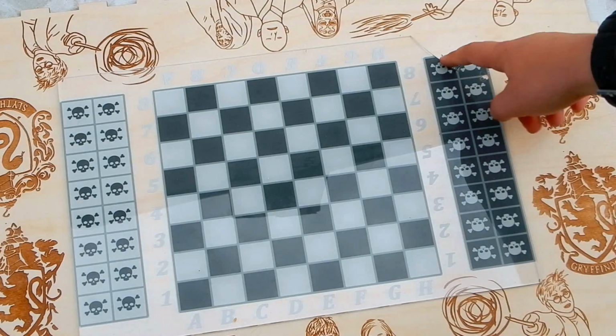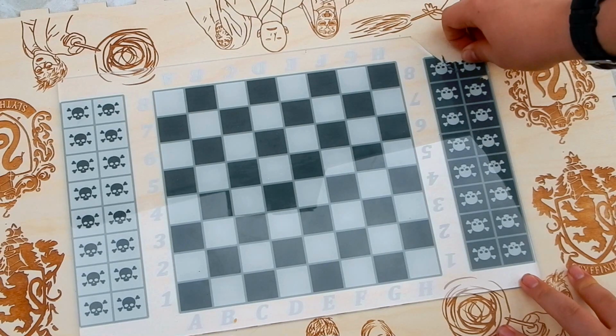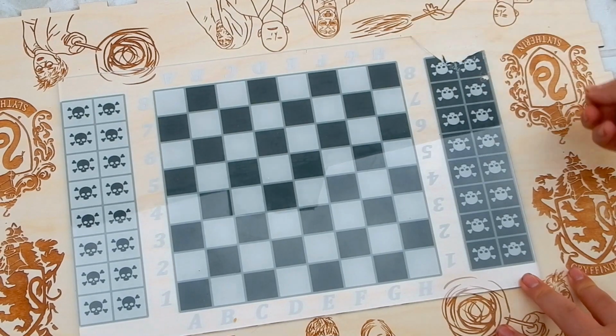So the company that engraved these parts for me said they could not only engrave but also just print. So I let them print the chessboard itself as well. But instead of printing it on the wood as they said, they printed it on some acrylic and then glued that on the wood, which of course totally messed up my measurements and made it too thick for the electromagnetic field to travel through.